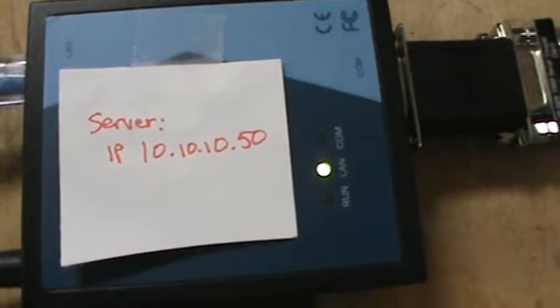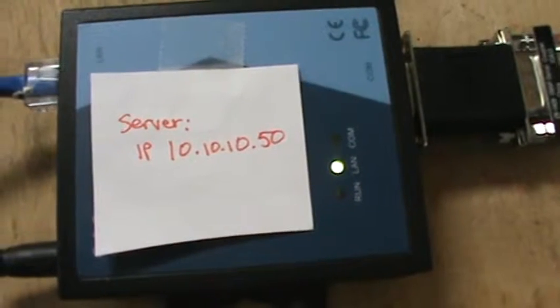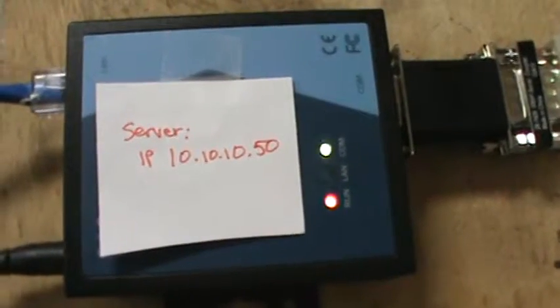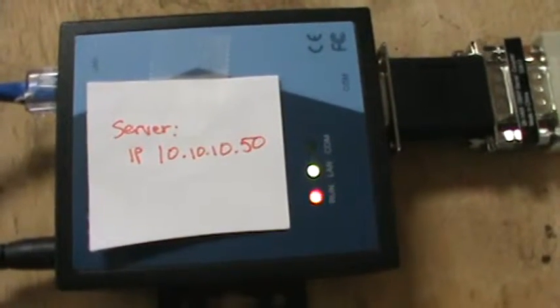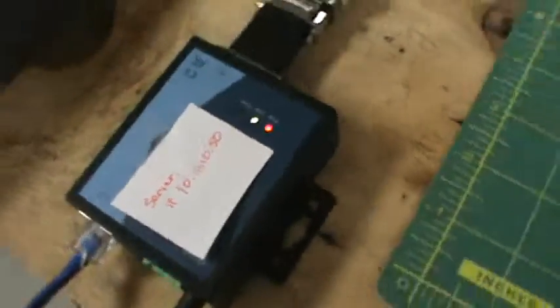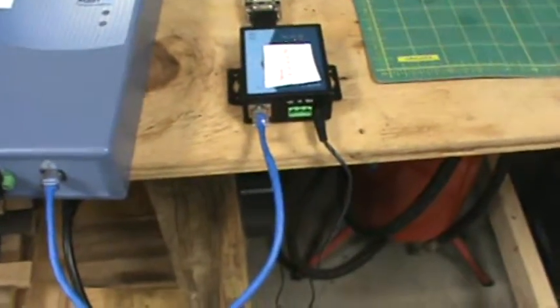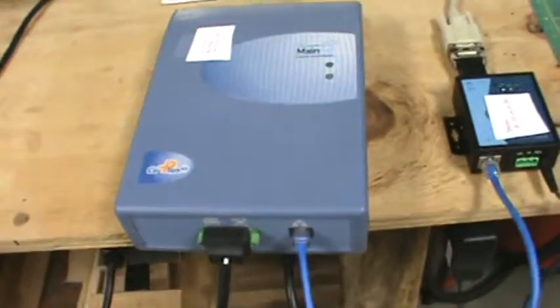Okay, we've got a LAN light green, which indicates 100 megabits per second communication with the CU. We've got the run light blinking, which indicates that the firmware is running properly. And we've got a comm light that blinks when the iLighting Manager sends commands over the serial. So that box converts it to IP, which puts it onto this blue Ethernet cable, which goes into the CU